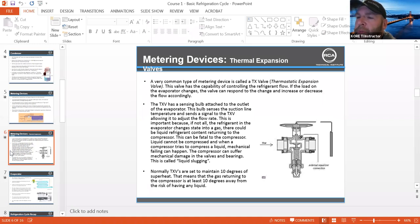The 10 degrees of superheat is a really general term. We're running Costco cases as low as four to six degrees. The low-profile coils at Maverick should be four degrees in the beer cave and in the freezer. Don't get stuck on that 10 degrees of superheat. Look at your manufacturer settings and make sure you know the superheat spec for the type of evaporator coil and case you're working with. Every manufacturer has their suggested spec on superheats.